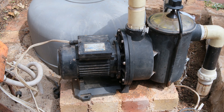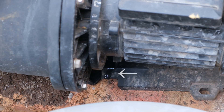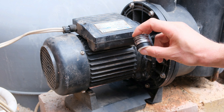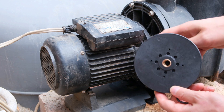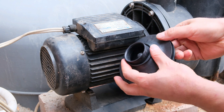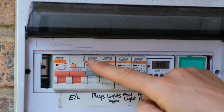This is a 0.75 kilowatt pump — the brand is called Quality. Where the motor meets the cavity there seems to be a water leak, and you might be able to see some of the water dripping out on the side of the motor. This is the mechanical seal on the inside which I need to get to. There's also an o-ring which goes here, a spare impeller, and another o-ring — I have all the spares in order to do this job. Make sure the power is off.